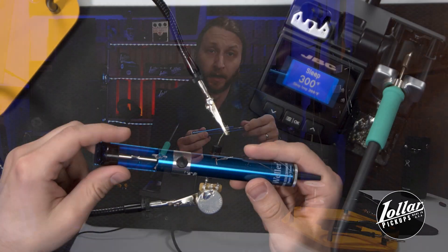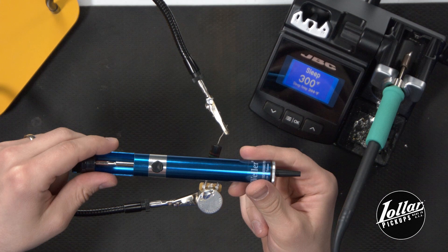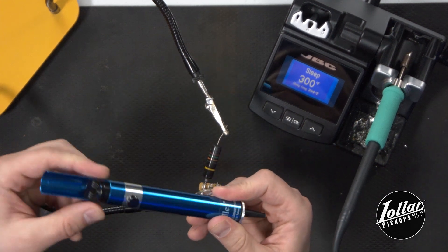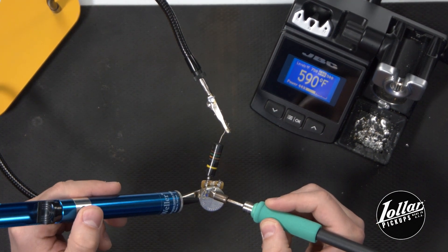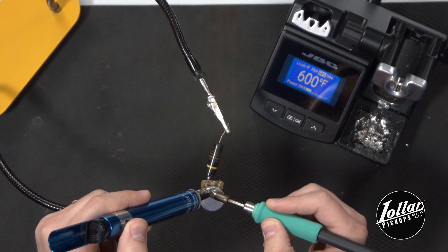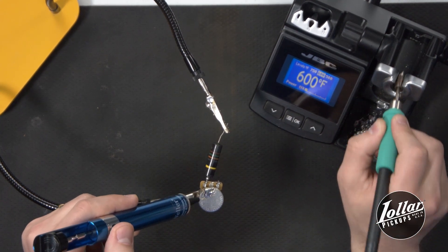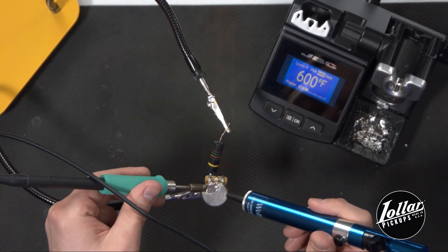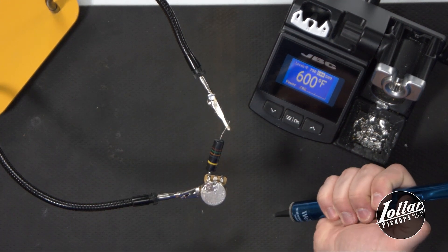Ours is a little more of a basic type. It has a plunger, a nozzle, a trigger, and a reservoir that sort of acts like a reverse syringe to remove solder. To demonstrate how to use this solder sucker: you start by pressing down on the plunger to arm it for suction. Then you just need to heat the solder to a melted pool, and then quickly, before the solder dries, press the trigger. Sometimes it takes a couple of tries. Looking good.